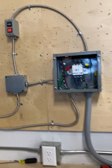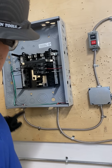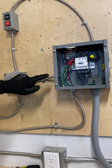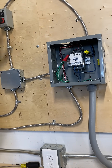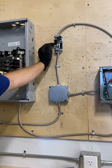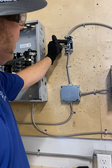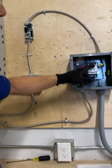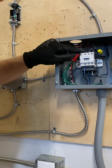To control my push-stop button, I'm running off of my circuit number one with my neutral coming through here, and my neutral's coming spliced in my J-Box here, coming to my A2. That's the designated position on that. My line is coming in to the first top position, number five. My contact is making contact from six to three, and wiring accordingly through MC to A1, A14, and A13.